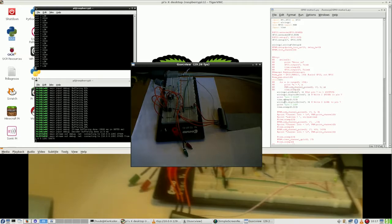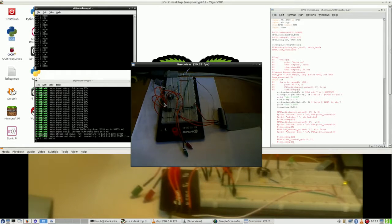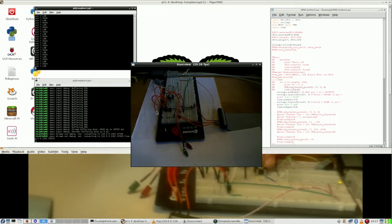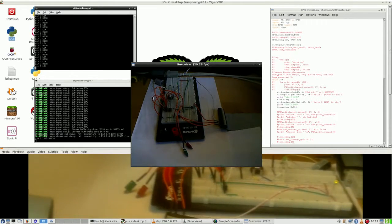What will be next? I have to decide yet, because as a reminder, this op amp is not doing its job, and I have to find a solution for that. More or less, by the way, because this particular jump wire, am I right? No, I have to show another one. I think it's this one. It is connecting the signals from the pulse modulation wire to this LED, but it is not going through the op amp, so I can just as well remove it.